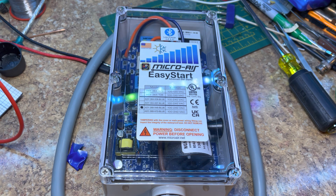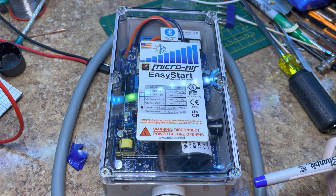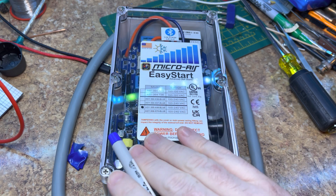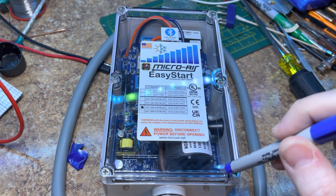I have some other smaller AC units that are mini-split variable frequency drive type units that don't have this issue. But my big unit, which is a three-ton conventional cool with a start capacitor — that unit is, it is stupid for lack of a better term. It gets a 24-volt relay to close and it kicks on and the compressor starts. There's no electrical control boards, nothing like that. One of the problems with an AC motor is when you're trying to start it, it has essentially almost zero impedance — it's almost like a direct short until it gets running.